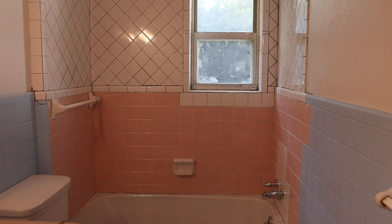We knew prep was important because we had done it in my house and we believed that's what gave us such great results. With that said, we knew that tile at the flip house had been painted before, so we wanted to strip the paint back before painting the white on. But when we began stripping it, that paint was just not coming off. So what I decided to do was strip just the shower area where the tile would be getting wet, and on the actual walls I just sanded it down and prepped it like I did in my bathroom, versus stripping it.